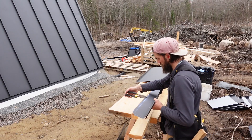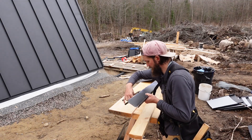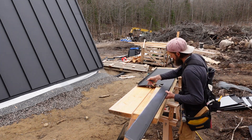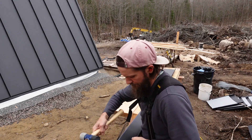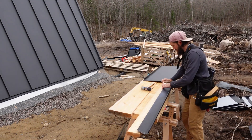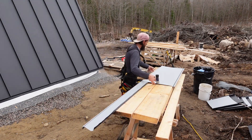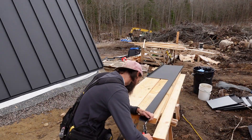Whenever you have a sheet of steel coming up to the edge of the window and you want to cut it, be sure to add an extra inch of steel material so that you can put a safety bend on it — that's where you bend it back underneath the steel. The reason for this is that it'll look better with a nice crisp bend, but also when you cut the steel and expose the unpainted metal it could be prone to rusting, so you want to protect it from the elements. I'd recommend renting or borrowing a brake if you don't own one.